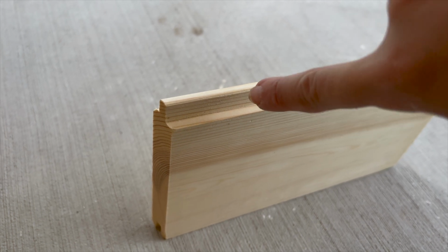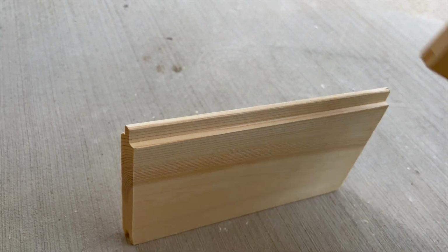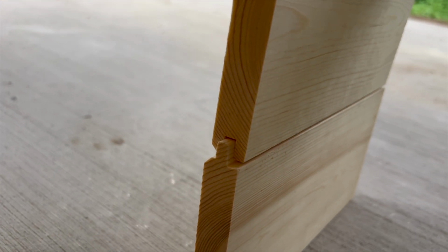Once the material is in place, you'll want to angle your brad nailer so that your nail goes right into the corner of the tongue side of the material at each ceiling joist. As you stack your materials, your nails will then be hidden.